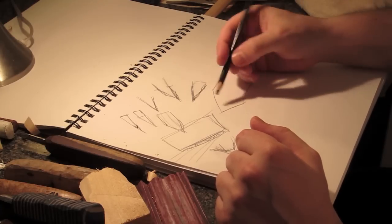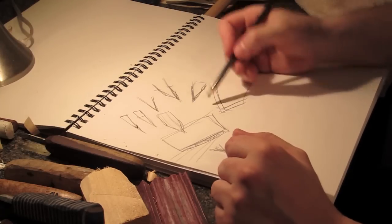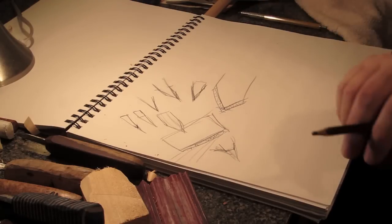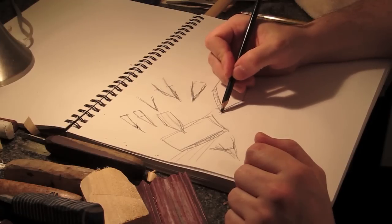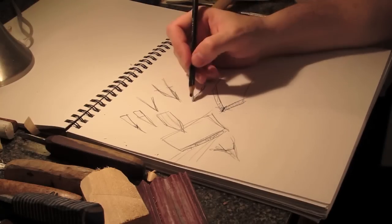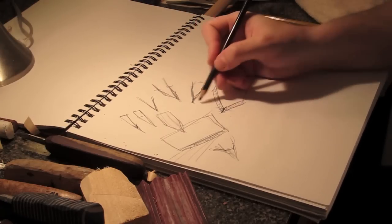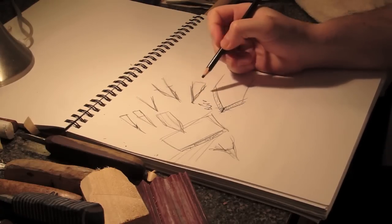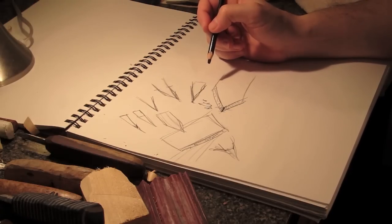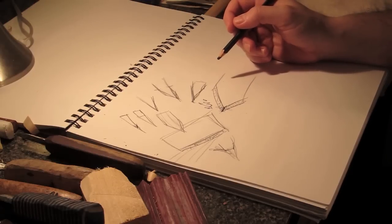You need to make sure you get a burr on it. Basically, when you're taking off material, you come back to form a new point. The steel gets so thin that instead of being ground off, it moves to the side — it gets to a certain point and turns into tin foil, which is flexible and can be torn because it's so thin. Steel also bends at a certain thinness — that's what forms the burr.